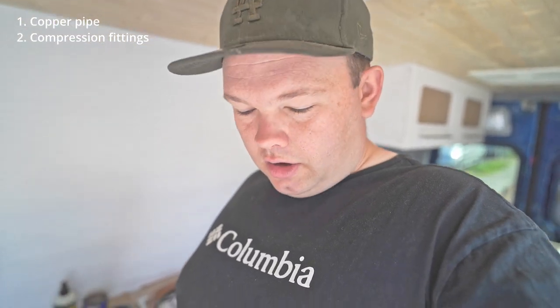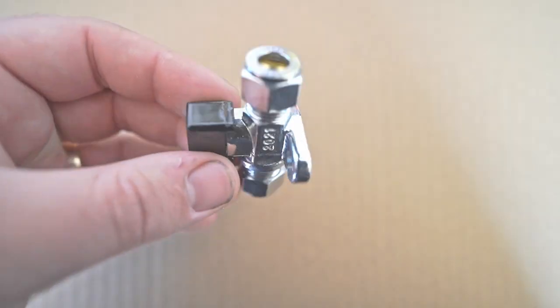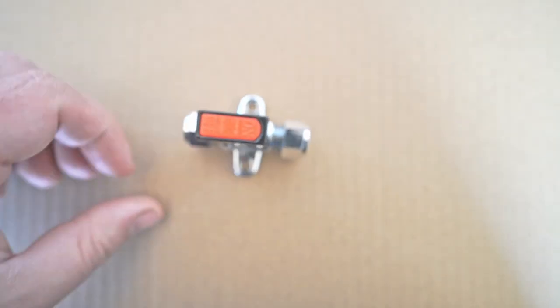The next thing you've got to use on those copper pipes is compression fittings. These compression fittings have an olive inside — you put the olive on the pipe, do up the nut onto the fitting, and it squashes down to make a gas-tight seal. I try to limit as many joints in the gas system as possible. In my installs I have one connection at the appliance and one connection within the gas locker — that way you limit any chance of leaks.